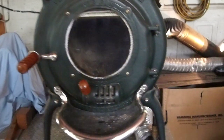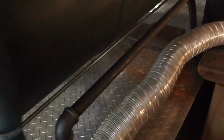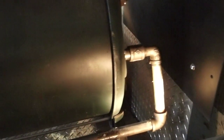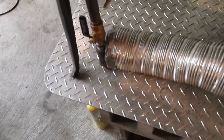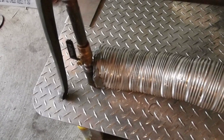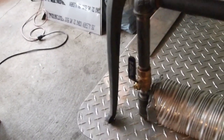It seems in his mind, and I agree, that it doesn't have to supply 100% of the air to the stove. As we walk to the back of the stove, you can see some 3-4-inch black iron pipe. It begins with this 4-inch aluminum, which is supplying the air from outdoors, and there's a ball valve which turns the air supply on and off.